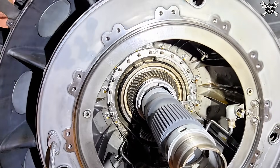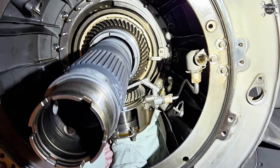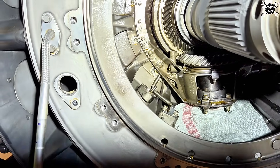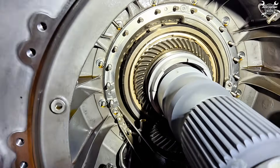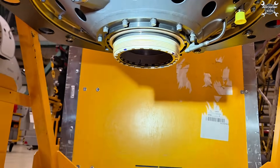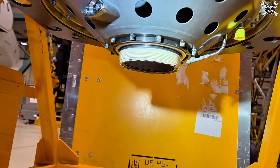Regarding the N1 shaft — we don't actually have a flywheel there. We have a sensor ring mounted on the fan shaft, and on it we can find 30 teeth. We can find it here in front of bearing number two; I just forgot to record it when I had the chance, so sorry for that.